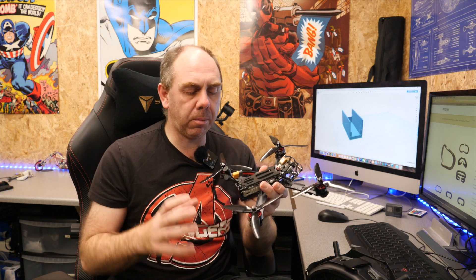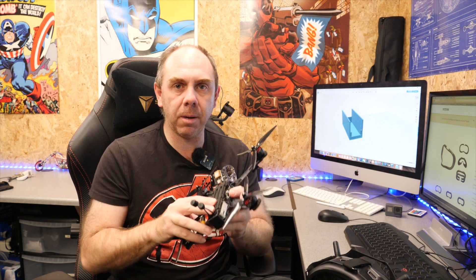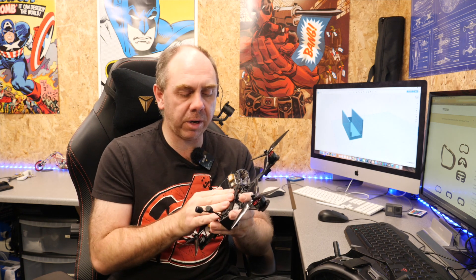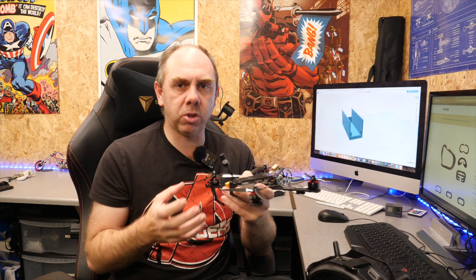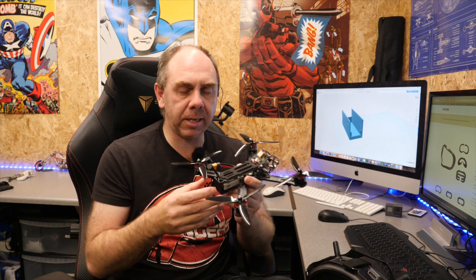DJI have been checking some logs on this and I've seen a few reports that they've noticed this behaviour in a number of cases. So if you are having issues with your air unit behaving strangely, not getting the range you should be, or the video just isn't right, try making sure you're powering your air unit directly off your battery if you're between 2S and 4S, or off a dedicated BEC if you're using 6S.